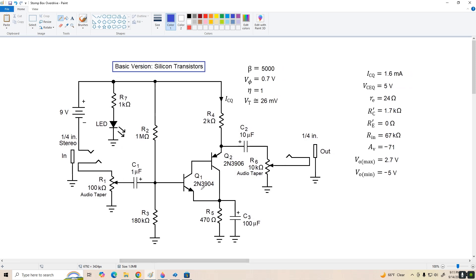In this version, I've used a 2N3904 and a 2N3906. You can substitute whatever your favorite NPN and PNP silicon transistors are and it'll be just fine. The only thing I changed was I increased the value of R3 to 180k ohms to compensate for the increased barrier potential of the base-emitter junction of the silicon transistors. If we go through the analysis, we get an ICQ of about 1.6 milliamps — a little less than the 2 milliamps of the previous version — giving just a slightly lower voltage gain, but still high enough to do the job.